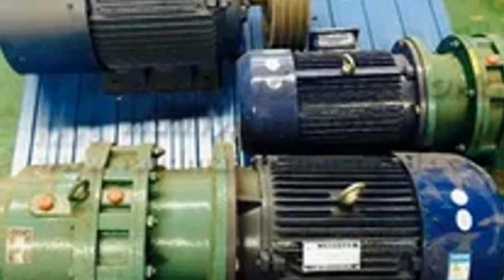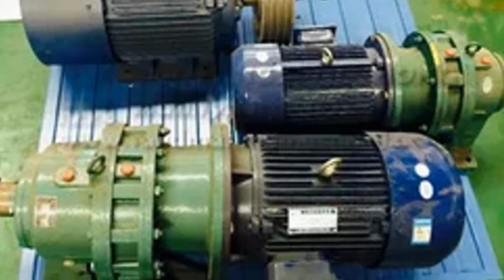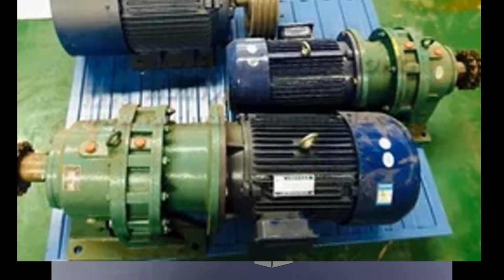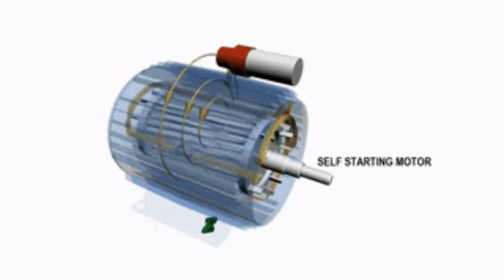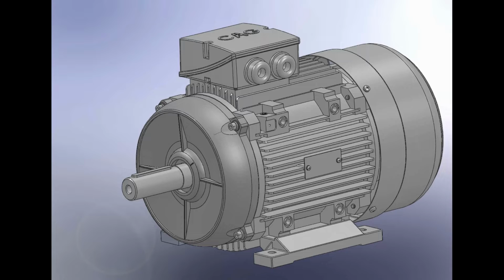Normally, a short-circuited winding similar to that of an induction machine is added to the rotor to provide starting torque. The motor is started either with full or reduced stator voltage and brought up to about 95% of synchronous speed, usually with the field winding short-circuited to protect it from excessive induced voltage. The field current is then applied and the rotor pulls into synchronism with the revolving field. This additional rotor winding is usually referred to as a damper winding because of its additional property of damping out any oscillation that might be caused by sudden changes in the load on the rotor when in synchronism.